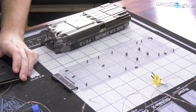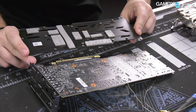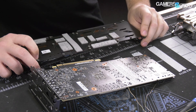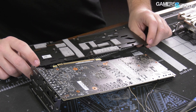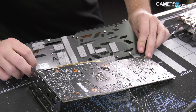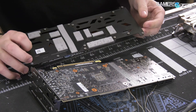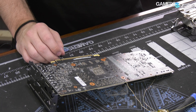20 screws in the back side — not too bad, but we do have to take off some other parts as well. The back plate has a lot of thermal pads on it. We have a test for the back plate versus no back plate in the review. Making contact to a metal back plate is certainly better than a hot box with no thermal pads, even if it doesn't do a whole lot for GPU, VRM, or memory cooling. It doesn't do negative things, and that's good.